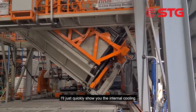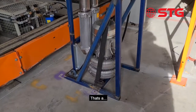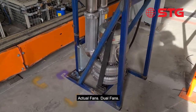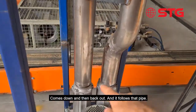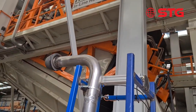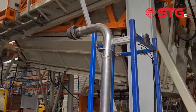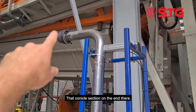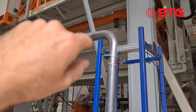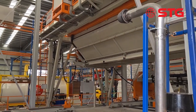I'll quickly show you the internal cooling. That's a five and a half kilowatt motor with actual dual band fans — it sucks the air in through this filter, comes down, then back out, and fires into that pipe that's got a bearing on the end of it. This whole assembly is on an air ram, so once the mould comes out and comes back into the cooling position, we activate the air ram which pushes the whole assembly across. That conical section on the end contacts into a conical section on the end of the cart, and then the air follows a path through, gets introduced on the opposite side of the mould, blows in, and exits out this side. Yeah, it's pretty cool.